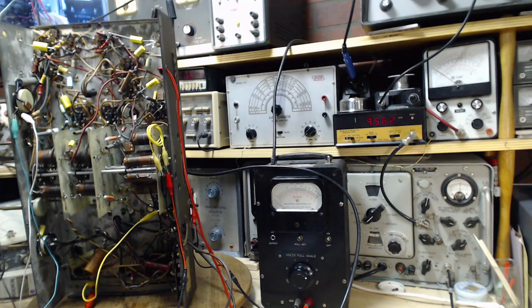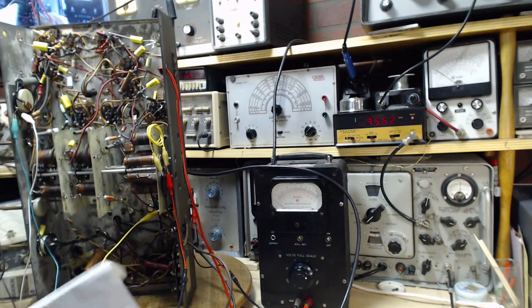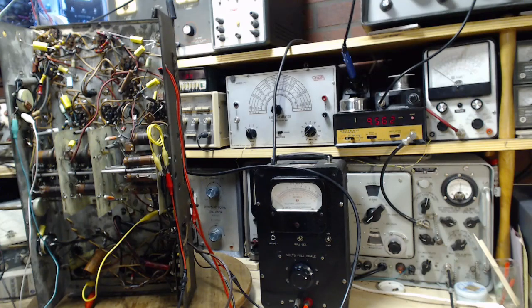So I'm really just basically where I was. I am where I was. My great idea I wrote down here just went down the drain. So I don't have another idea right now. I have to stop and form some hypothesis of what could be wrong with the radio. Why no local oscillator on the two higher bands?